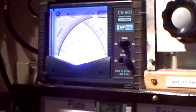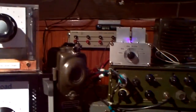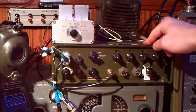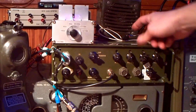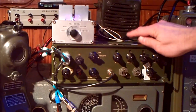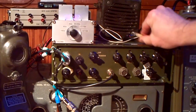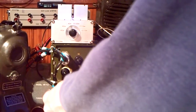It works with SSB too, sure. In the moment I have CW, and the only problem is that the GR345 has two cables for the PTT — one ground and two signal cables. One cable is for CW and the other cable is the PTT for the phone, for SSB. So what I must do is take this little cable and put it on the SSB side, and then I can use it for SSB.